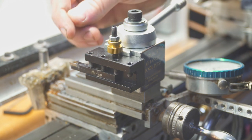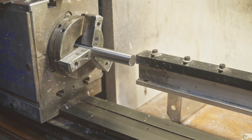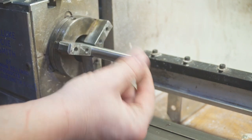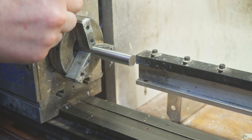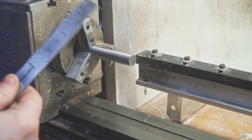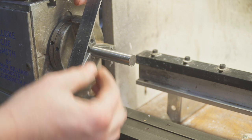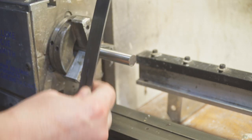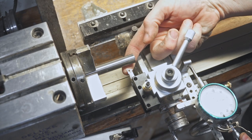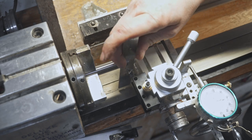To center the tool post, I'm going to use a piece of half-inch steel round stock — it's good and true. It's really useful to keep some around. You're also going to need a small square that will fit underneath the stock, as well as a piece of straight steel. I'm using a little six-inch straight-edge ruler — it'll work fine. You can use a piece of scrap as long as it is perfectly straight and flat. First things first, get your round stock into the chuck, then move your bit up to the round stock with enough room so your flat steel piece can slide down and fit flat against the stock.